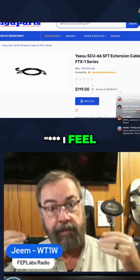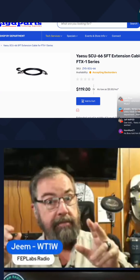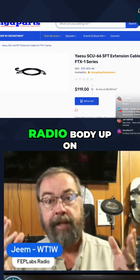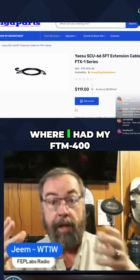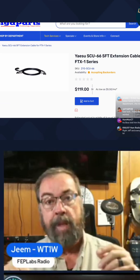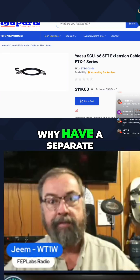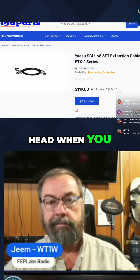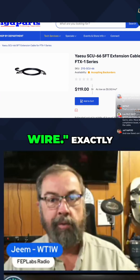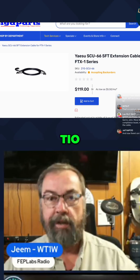When I got my FTM-500 two years ago at Dayton, Teo and I put it in the truck. I don't want the radio body up on my dash, I just wanted a head up there where I had my FTM-400 head, because the FTM-400 base was in the back and the cable is designed to be that close — kind of useless when you have a separate head. I looked at the cable and said, this is just an eight-pin RJ-45 straight-through wire. That's all this is.